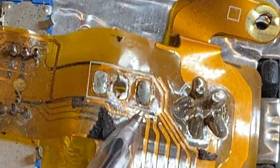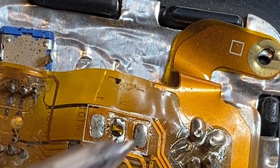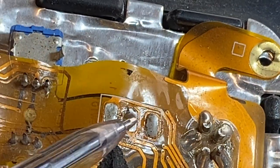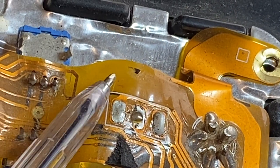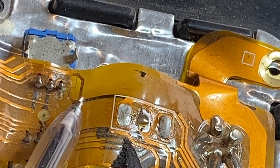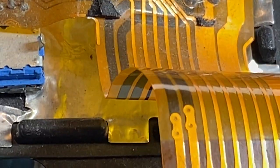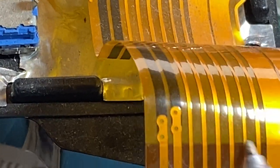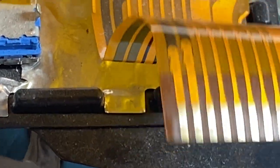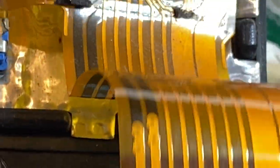You've got to clean everything up that was on there. Very, very clean. And make it all on a level plane, if you can. You've got to make sure there's nice curvatures. Can't have any sharp bends. Sharp bends, like I was saying, that happen here, which break the Mylar right there. You can't help that because of the way it's designed. It will break. If you move this in and out all the time, it'll break.